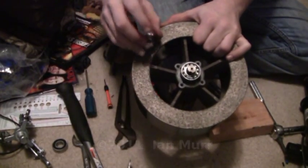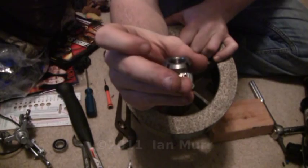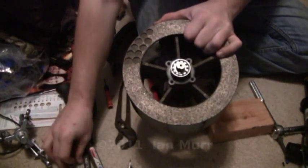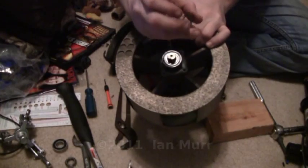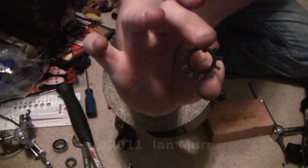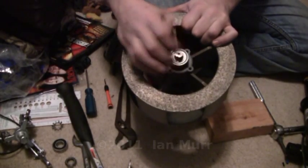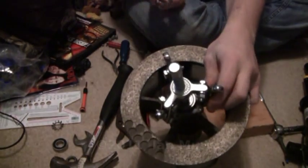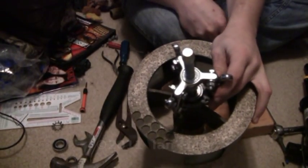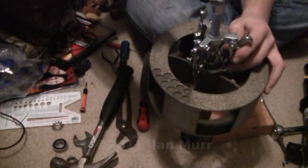The top of the nut is flat and the bottom of the nut is beveled — it has a little beveled edge on it. So you always put the bevel down. There's a little retaining washer here; the retaining washer just comes off. Now you can see — it has all those little teeth, and one tooth that locks into the keyway on the shaft. Now the bearing is exposed. Now that we've got the retaining nut and the washer off, we'll pull the bearing. You've got to use that little bearing retaining ring right there to pull it — you can barely see it in there.